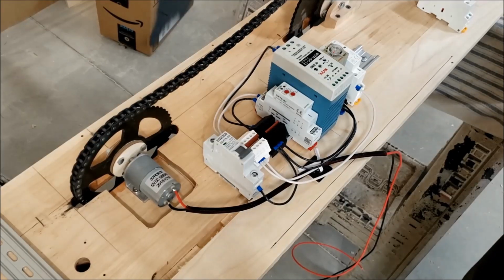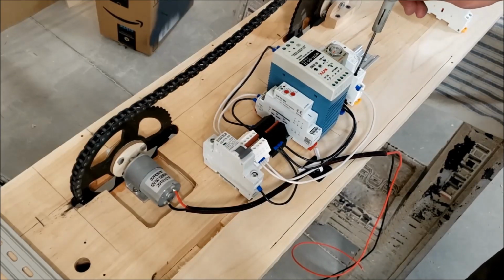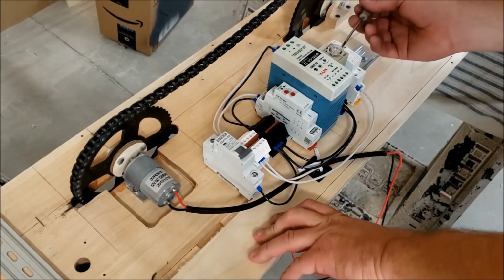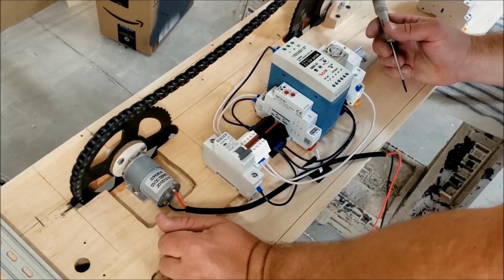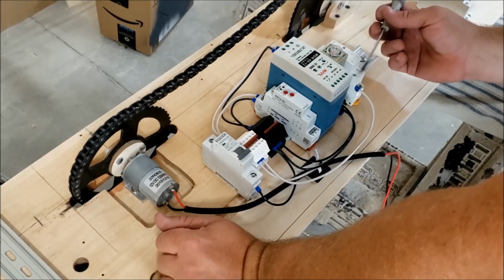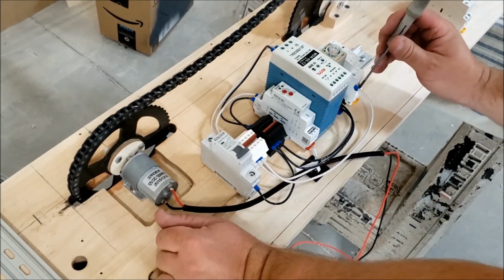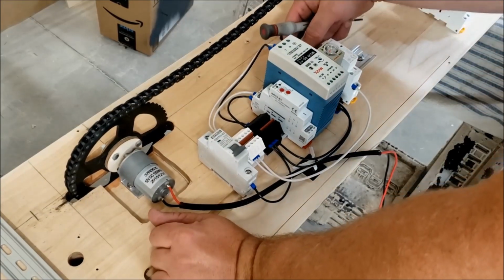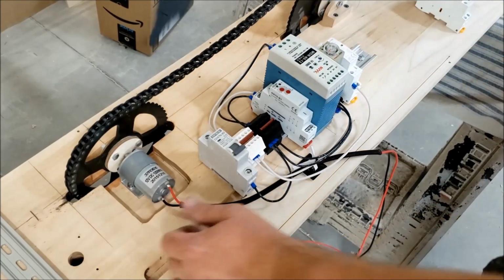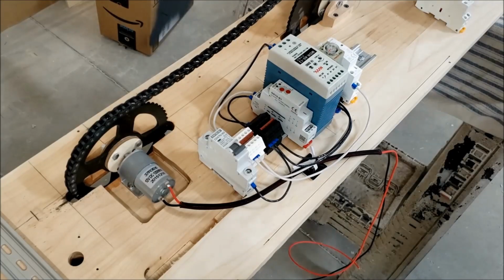This is a pretty dumb design of this contactor because A2 up top here is what activates our electromagnet, turns the solenoid on, and it's blocked by the bottom screw. So A2 blocks the bottom terminal, so I can't get to it. So there's no point to hooking those up right now until I get the bottoms in. Just kind of silly. So guess I'm hooking the bottoms now.